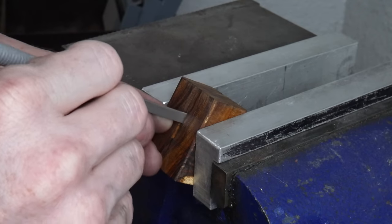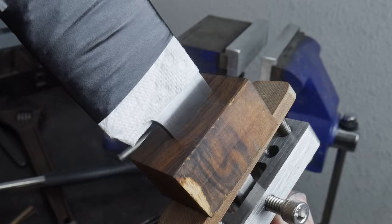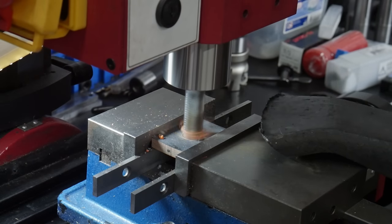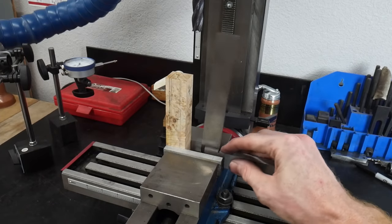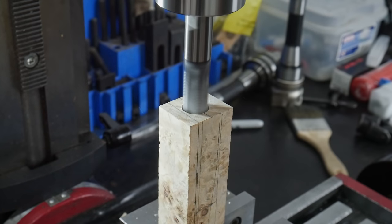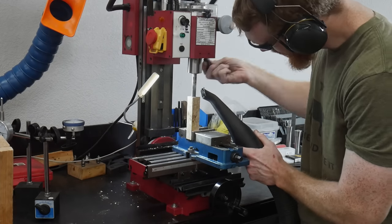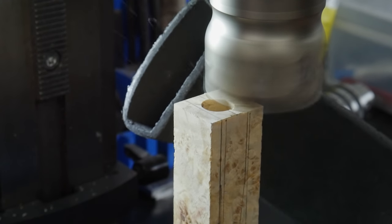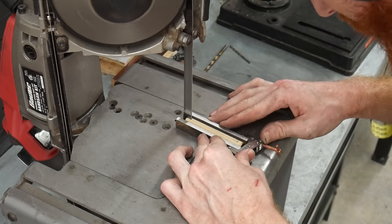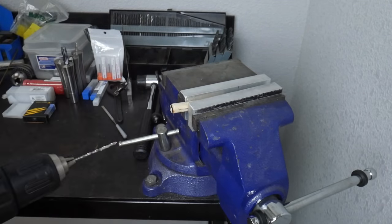Once I have the slot milled there is a tiny amount of hand fitting to square up the radius left behind by the end mill. I put my guard jack on the tang to apply pressure on the bolster and check the fit — overall I'm pretty happy with it and no daylight is visible from the side. Next I use the 1/2-inch end mill to drill a hole in our G10 spacer, then move on to the box elder. I measured my tang, marked the depth on the end mill with a Sharpie, and drilled the hole about 2-3/4 inches deep. I also made a little skid to hold the dowel, slotted it with my porta-band, and drilled a hole in the bottom of the dowel to prevent hydraulic lockup when assembling with epoxy.